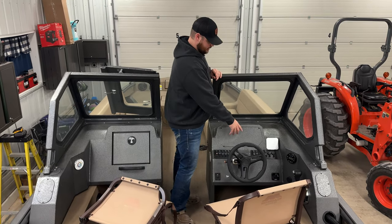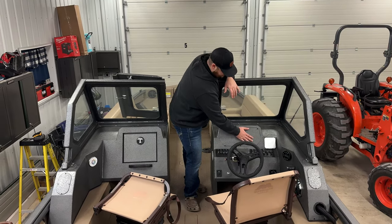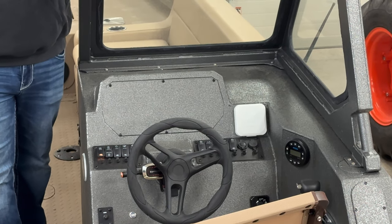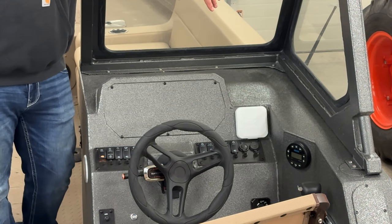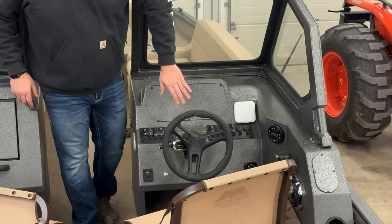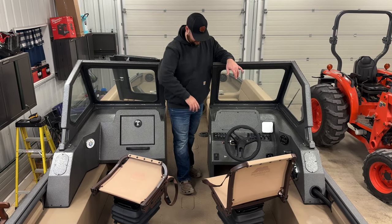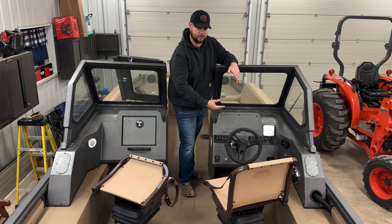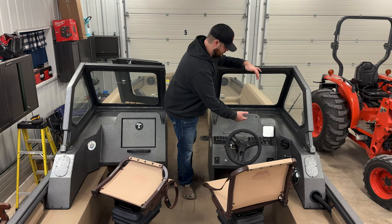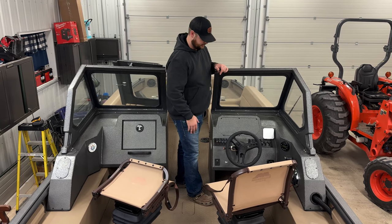I went with the Suzuki gauge for all my information, and I ordered this boat without any gauges in the dash. Normally they'll put five gauges. Some people will do no gauges except a fuel gauge. But you really don't need a fuel gauge anymore — with these digital gauges they're far more accurate than the factory fuel gauge, and they look a lot cleaner. My intention is to flush mount a sonar in this dash. I just didn't want any other holes to deal with. This plate screws right out, so if you want to put a sonar you can take this out, put it on your table, cut it out — perfect. And when you go to install your multibar graph, it mounts up here and you can pull this panel out, reach in really easy — all open access.